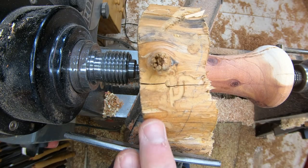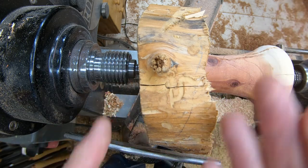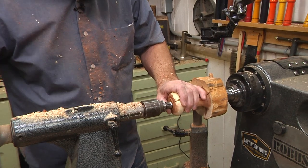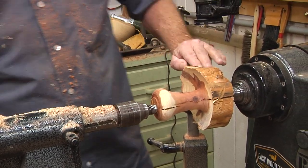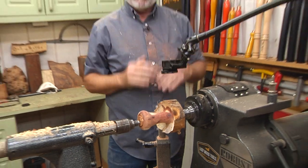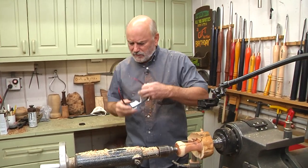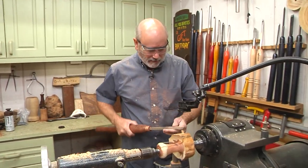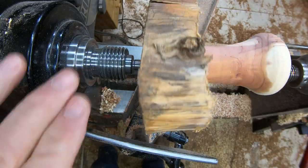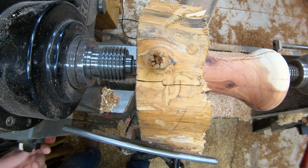We've got the curve done the way I wanted it. Looking at the top — this is so cool because the top angles down. But if I leave it in this position and start cutting the top, it's going to be flat across the top, and that's not any fun. So I'm going to slowly move this off about a half inch, maybe, off center. Now this is wobbly. The top almost looks flat, but when I cut the top it's going to have a bit of an angle on it when I'm done. We're going to grab our straight carbide again, make sure we're at the right height. Nothing's going to hit.